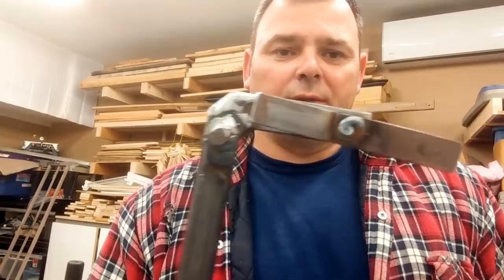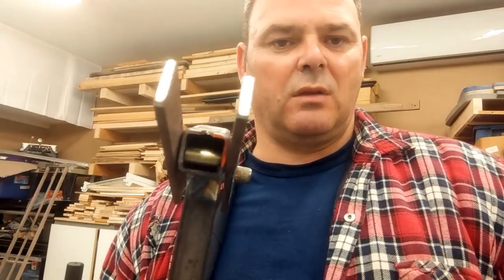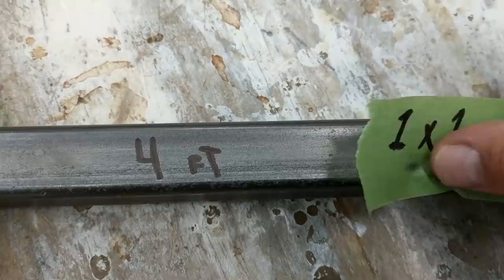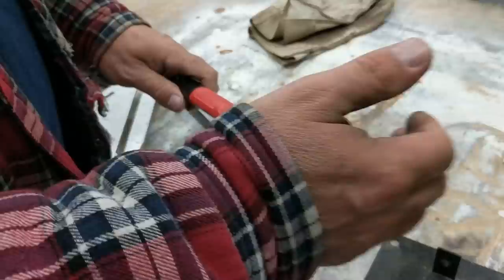I'll show you how I built it today. It works awesome — even the pallet puller. I had a lot of pallet wood starting to accumulate on the side of my house, and I gave away my good pallet breaker, so it was time to build a new one. This piece I got from Princess Auto — it was four feet long, and I cut the first piece at three and a half inches at 45 degrees with my grinder.